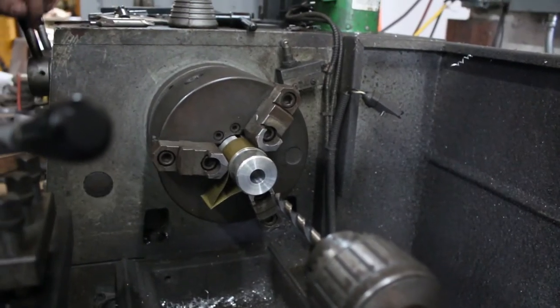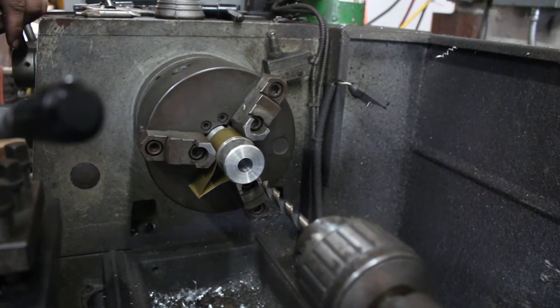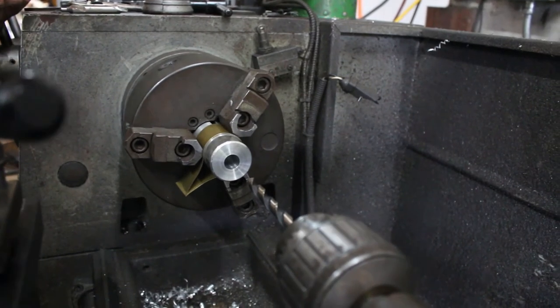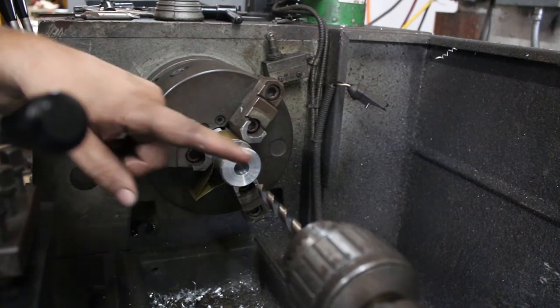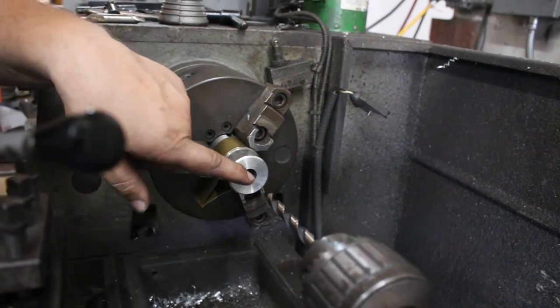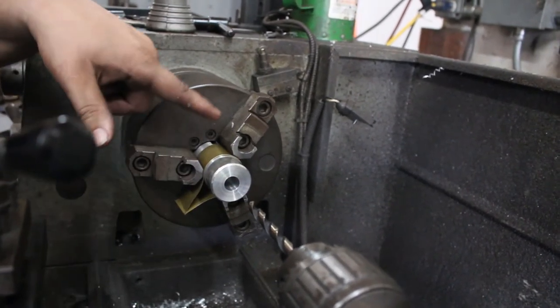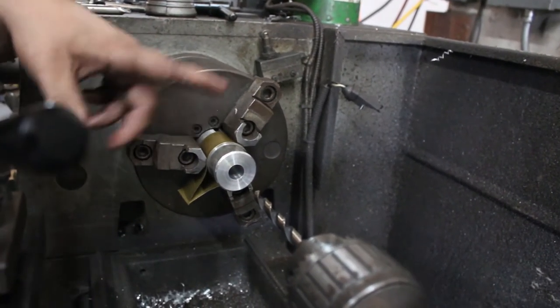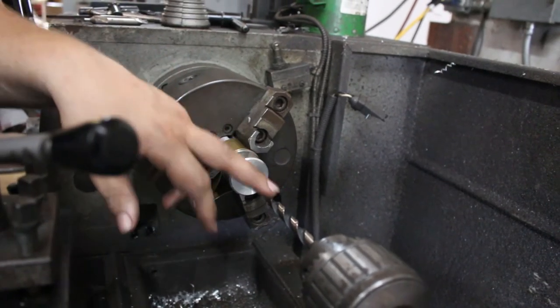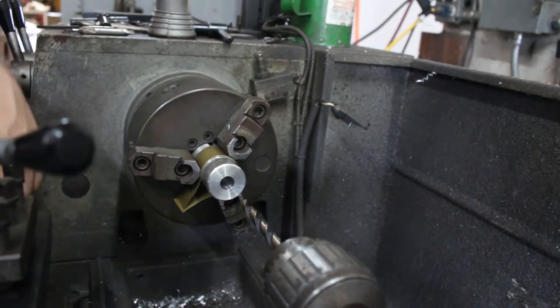I just drilled the larger recess hole for the shifter, so it'll slide all the way down to the counterweight. What I still need to do is drill for the tap — this is 11/32". The floor of this hole is where I'm starting, about 1.9 inches in. Going to go about three-quarters of an inch, drill it, tap it — it should go straight on the car.